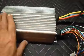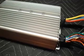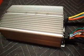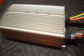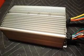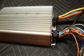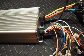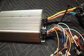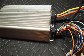I got her all back together now — should do the job. The reason I opened it up was I was wondering about the use or necessity of a contactor and also a pre-charge function or resistor, basically to charge up the caps inside this puppy. So we don't have that 60 volts of energy inrush smacking them caps hard and end up popping one of them out. But I didn't see a pre-charge resistor of any kind in there.